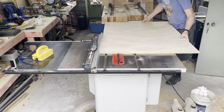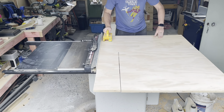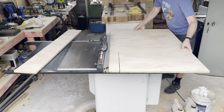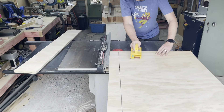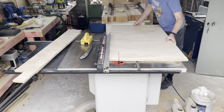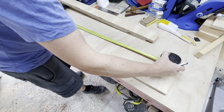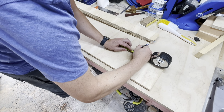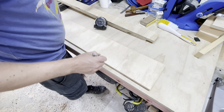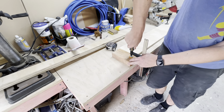First, cut the base and sides of the sled out of 18mm or three-quarter inch ply. The base needs to be wide enough to fit your router — for me that was 175mm or six and seven-eighths inches. The sides need to be wide enough so they can't bow; mine were 80mm or three inches. The length of your sled depends on your table width — my table is 760mm wide (roughly 30 inches), so I made the sled 1020mm or roughly 40 inches wide. Your sled needs to overhang both sides so it can ride along the guide rails and the bit can reach the table's edge.